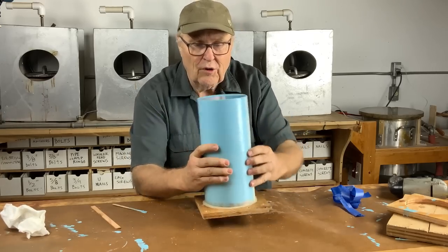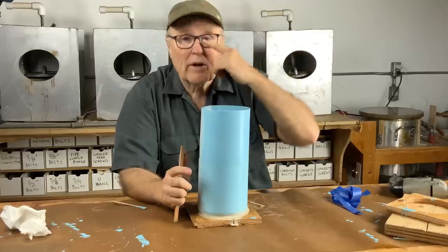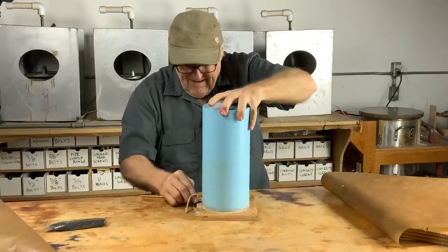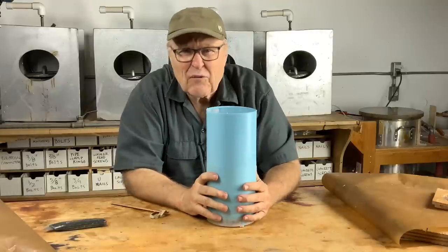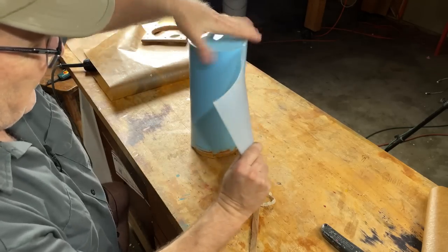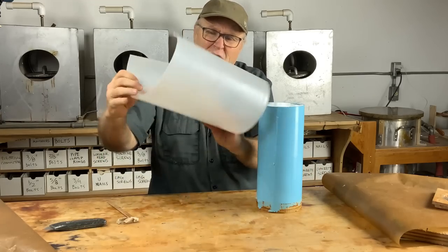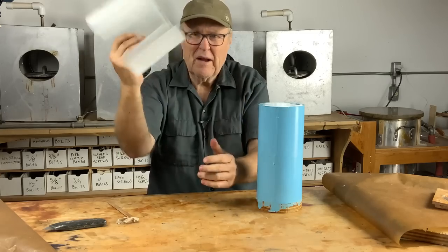This case did a good job of making this mold. But the downside to this style of case — which was basically recycled out of old gallon jugs — is that it's going to make a perfectly lousy cradle for casting. So what we're going to have to do is make a cradle. That should just pop right out — and it did. This is the genius of wax. Look at how easy and quick and painless taking apart this mold case was. I'm shocked — I just used my waxer to weld this together and it held up plenty strong. Comes right apart, but held up plenty strong for making this mold case. That was a win.